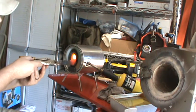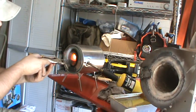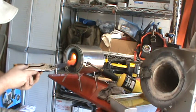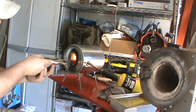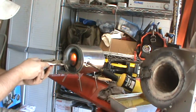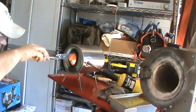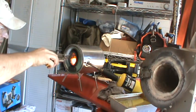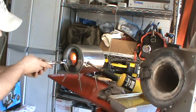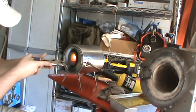Starting to really get some color on my blade now. I'm getting up there — I've got my whole blade preheated. I want to get a nice spot past magnetic, so I'll start moving it around back and forth. I want to get that heat to go all the way down my edge.